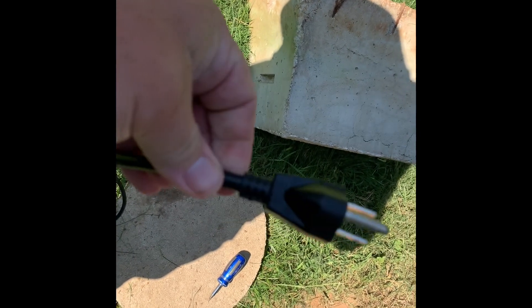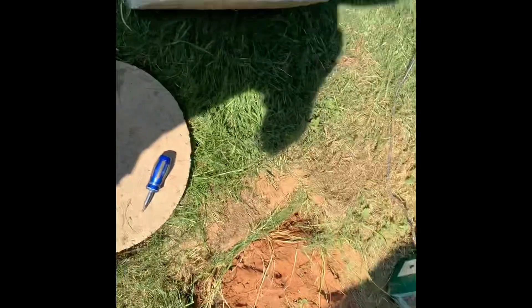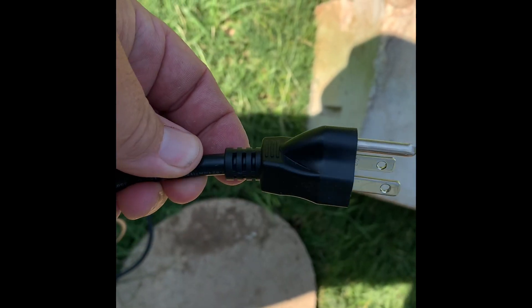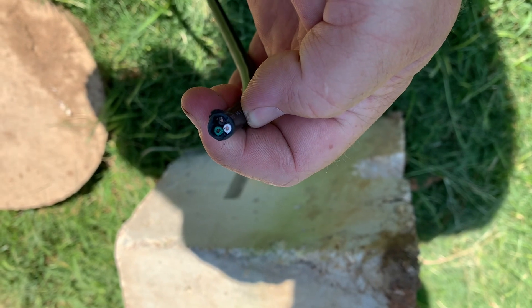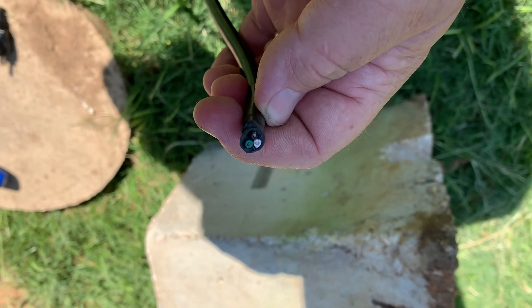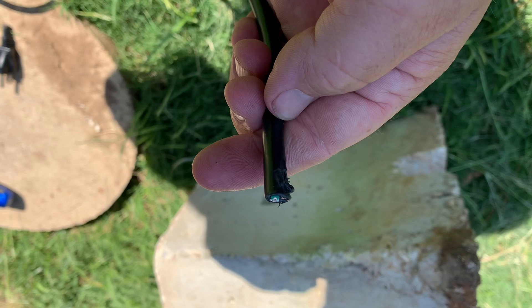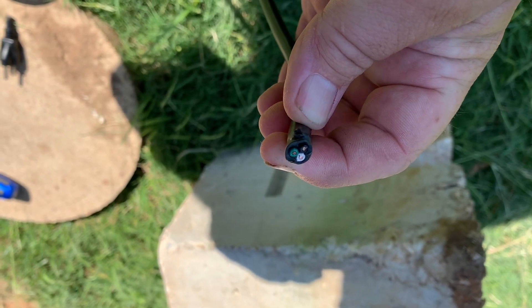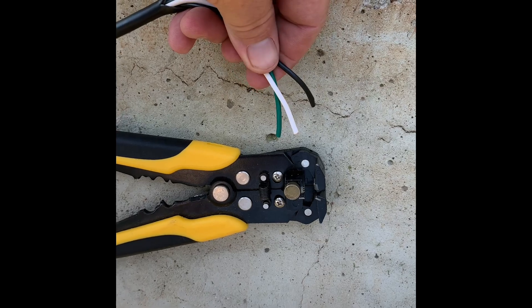Since mine came with a plug, I am going to cut the plug off and set it up so that it's hardwired. I don't have an outlet down here. So I'm going to cut this and pull out the different color wires and attach them directly to the fuse panel there. You can see the three different colored wires in there. I'm going to isolate them and strip the ends so I can attach them where they need to go on the fuse block. I'll use a razor blade to cut down the side to access it, then use a wire stripper to get the ends undone and get about half an inch of wire exposed.